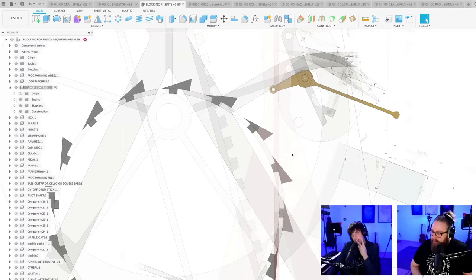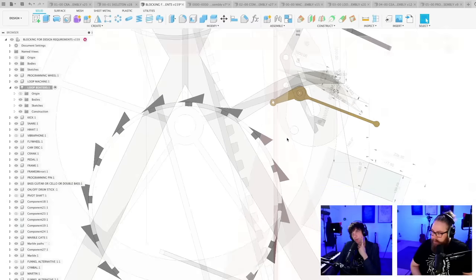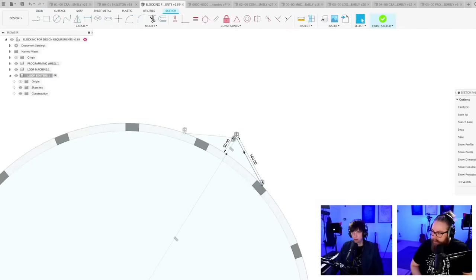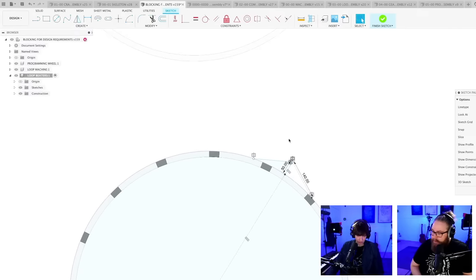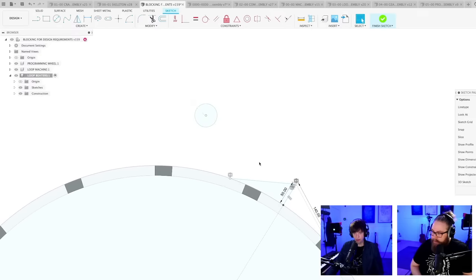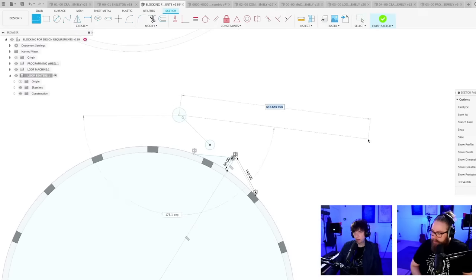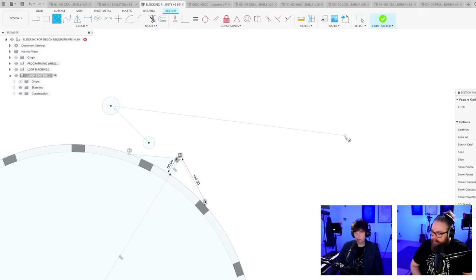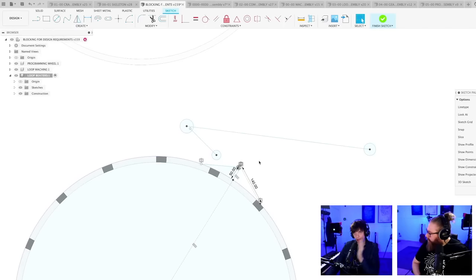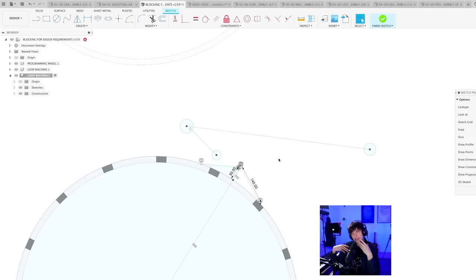I really hope I can make this work. If we put this pivot close to the loop, for example, I can show it to you in this sketch. So let's say we put the pivot here, and the reader here, and then the drumstick goes out here. Then this works because the thing is pushing up, but instead of pulling the mechanism, it's pushing it, which is a little bit less preferable. But I think as a trade-off.